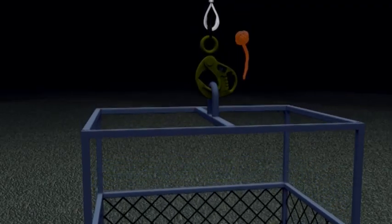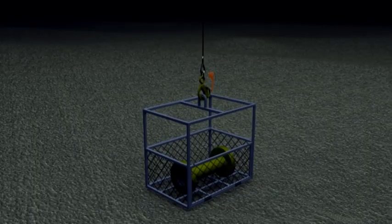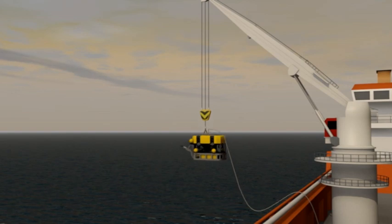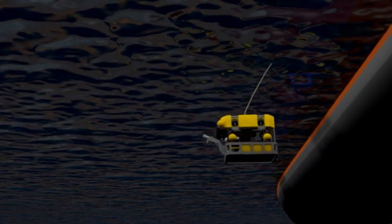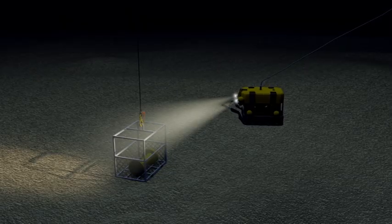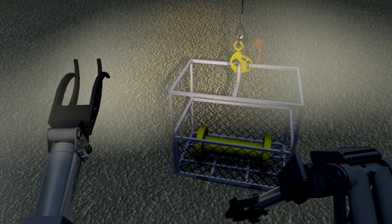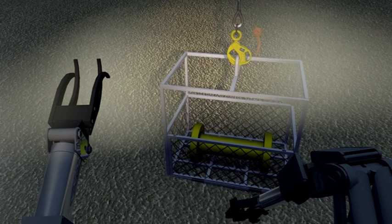Load discharge. Once the item has been landed on the seabed or another structure, safe and positive discharge of the load is easily achieved, as Nautilus ROV hooks have an unobstructed and outward opening locking arm, which eliminates the potential for the fouling of slings and unintended hookup.